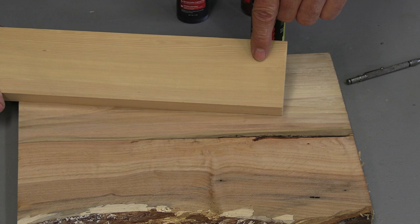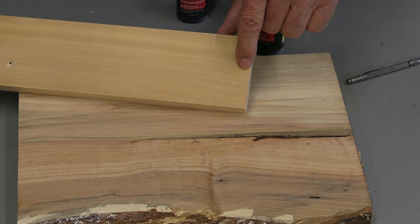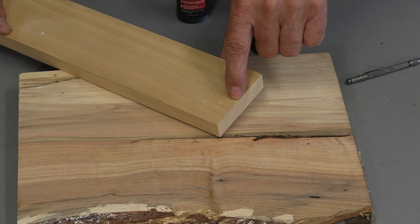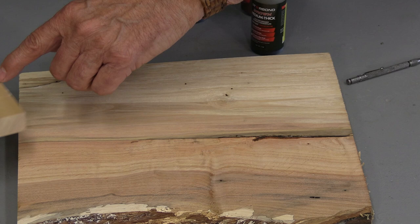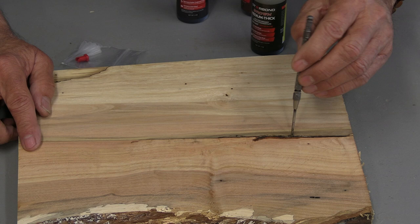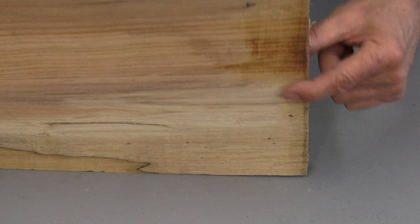Let me show you the best way of doing repairs when it comes to cracks and knot holes. There are basically two kinds: if you look here there's a crack in this board at the end, and if we flip it over you can see that crack goes all the way through — that's one kind. If you start filling that crack with CA glue, depending on how wide it is, there's a good chance the CA glue is going to go all the way through, and if you're working on your workbench you're going to end up gluing your wood to the bench. Here's another crack — much bigger — but when I flip it over there's no crack on the other side, so this is a crack that does not go all the way through.